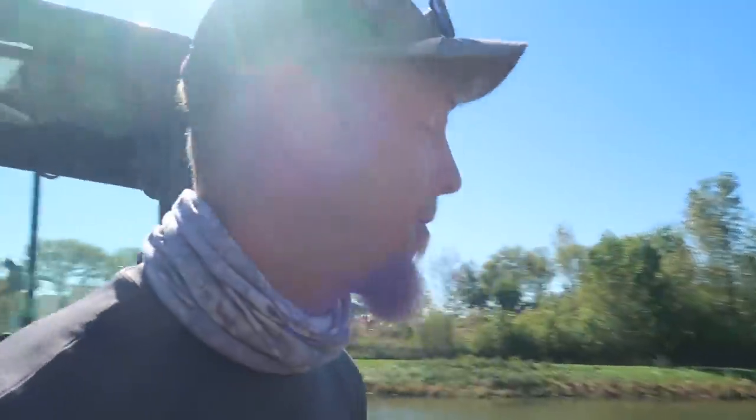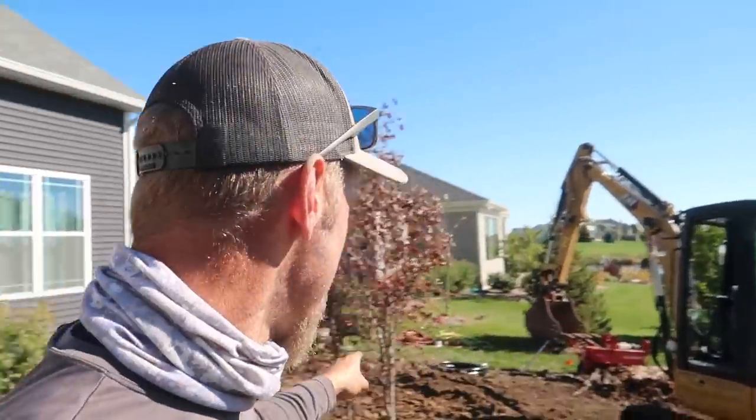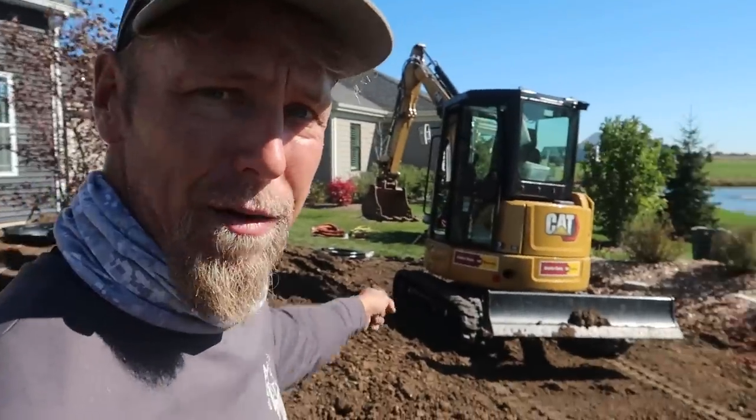There's a lot to take in, but we'll tackle it in baby steps. The plan is to rock the pond completely before worrying about anything else, because starting on the fire pit area or pondless reservoir would cut off the back side edges, making things harder. Once the pond is about 90% done, we'll move over and start placing retaining stones on the back side and work on the pondless portion. Fabric, liner, and then we're going to get rocking.